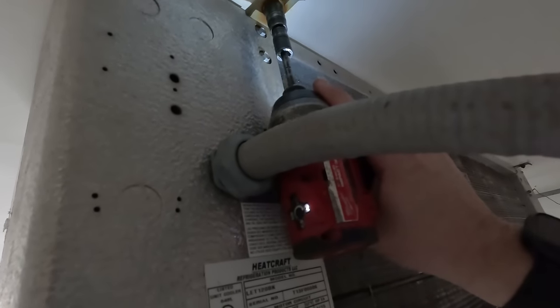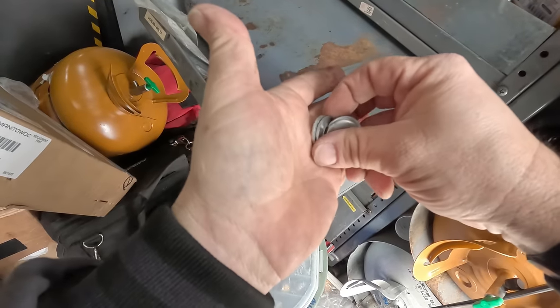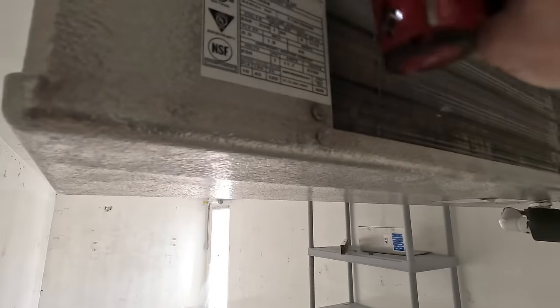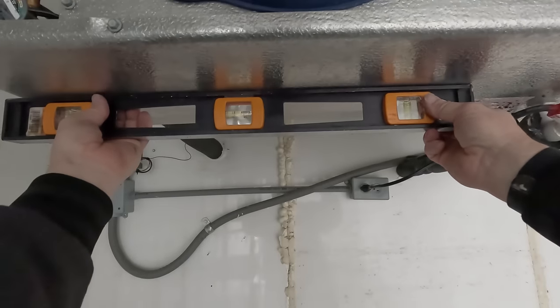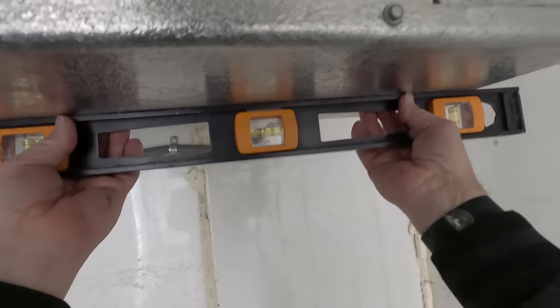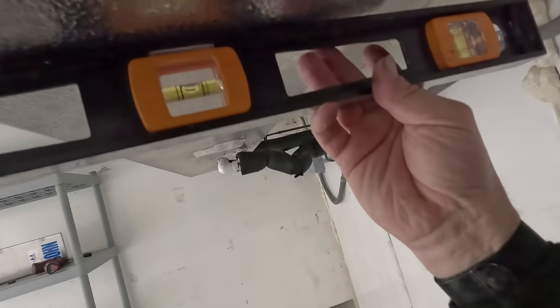I'm not seeing any bolts coming up through the ceiling, so we might be able to lower that down and put some washers in there. We're actually high on the left. We'd lower it — that would bring it down. A couple washers here, two each, give us about an eighth of an inch — that's all they got, little legs. Two washers. Hopefully it didn't make it worse. Looks dead-on to me. Just about a sixteenth more on the right, but I don't want to take it too low.